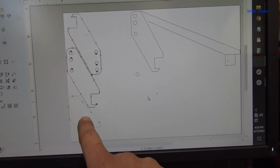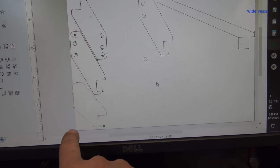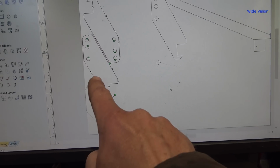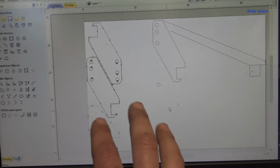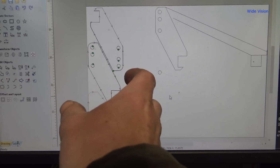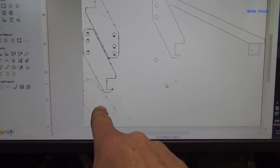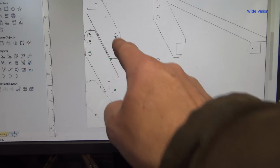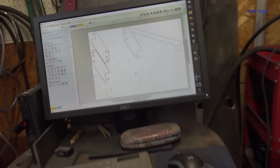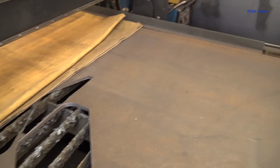Okay, I left the tool path here of the piece we just cut out. Machine is 0, down here, so that way I could fit the next 2 in there. I think this would have fit on the plate a lot better if I had turned these straight up and down to where they were this way, but since I already cut out that piece, I left them like this. So I'm going to go with it. So let's get you set up and watch this cut out.